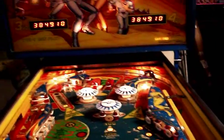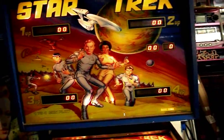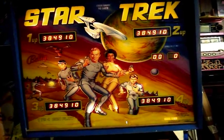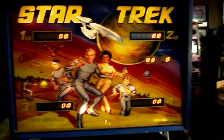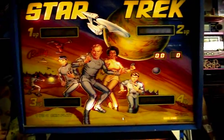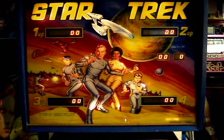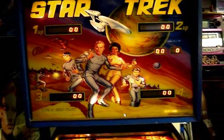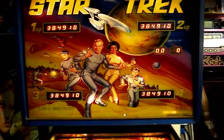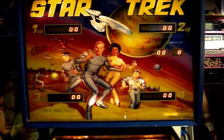the game was working when I first got it years ago, and a few years later the battery on the MPU leaked cadmium. It had the rechargeable nickel cadmium battery on it, and it created acid, well, not acid, but cadmium damage on the MPU. So I fixed that, and it's been working pretty much all these years without any problems. I did replace it with a nickel cadmium phone battery years ago, and I should have moved it from the MPU, but I didn't.